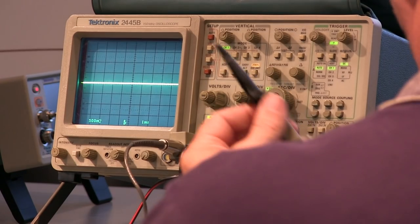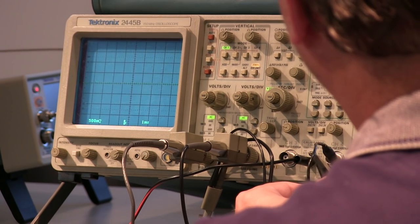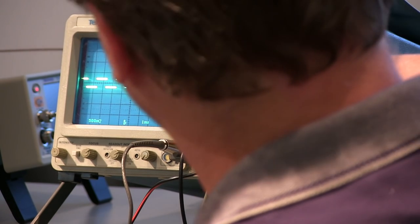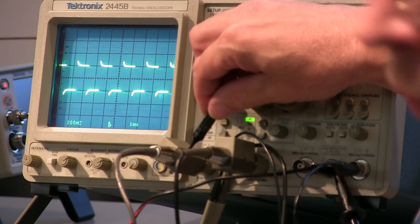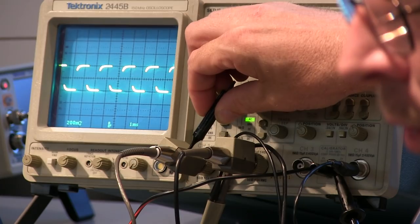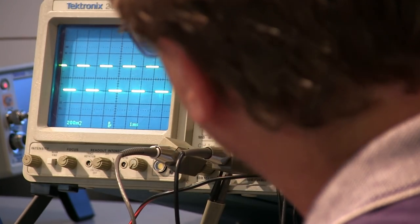And let me go into the calibrator over here on the scope. This one looks like it's pretty well compensated, doesn't it? So a nice little 1 kilohertz square wave. But look what happens if I misadjust that. There I'm overcompensated. If I adjust that down, now I'm undercompensated. And if I adjust it just right, now I'm properly compensated.